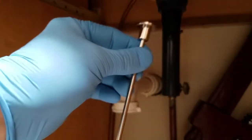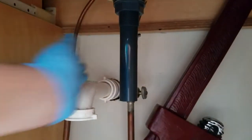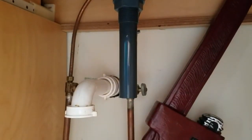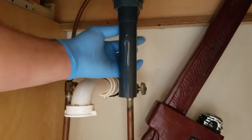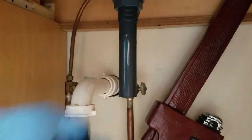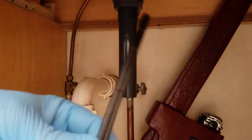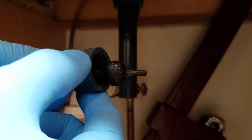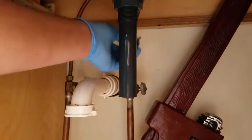That should be good. Now we're going to take our rod and drop it in to the back of the faucet. It's behind the pipe and doesn't even come down all the way where we can see it right now. We're going to take this part and it goes into that socket, so we'll unscrew the cap off the back and put our rod in — it needs to be flat like this; there's an indicator on the side to help you out. We're going to screw that in with the rod.